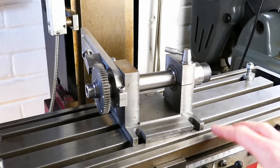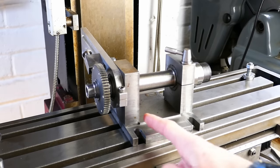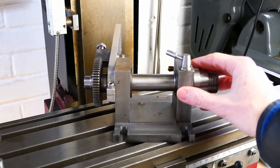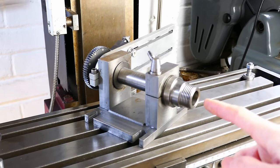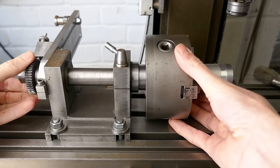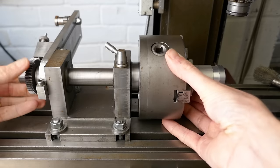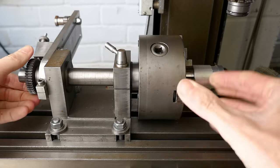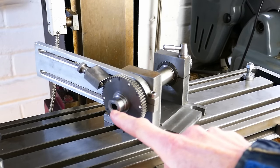The dividing head is mostly constructed of steel. The thick steel base is bolted to two steel uprights. The steel spindle was made on the lathe and has the same spindle nose as my Myford lathe, because this allows me to use my lathe tooling on the dividing head — things such as chucks, collets, and taper tooling. The spindle has a number two Morse taper and is bored through to allow a drawbar to be fitted when using taper tooling.